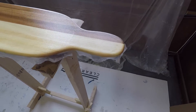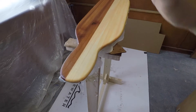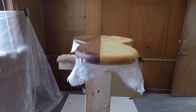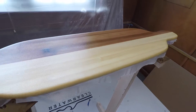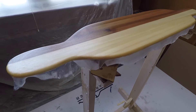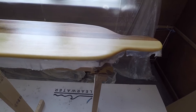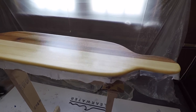I've also been working on some long boards, and what makes these a little unique is that normally a long board is just pressed plywood to give it shape, but I went for gluing it up solid and then milling out the shape. It's got a nice concave to it, and when you glass them like a surfboard it gives a nice lively springy feel. A couple of people who actually know long boards have gotten on these and they really seem to enjoy them.